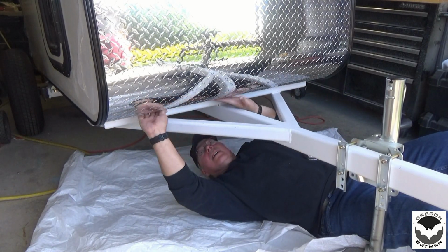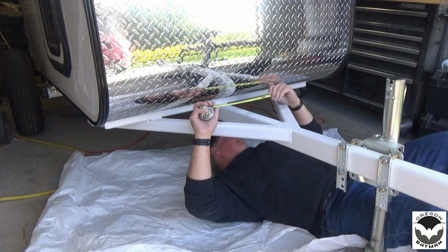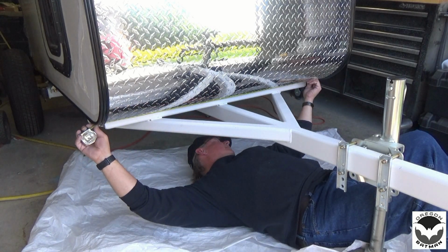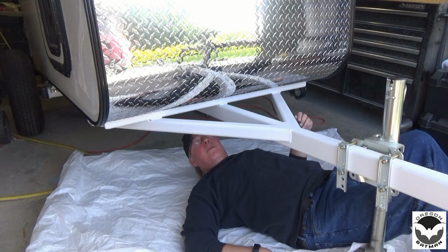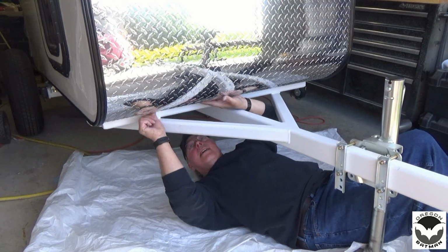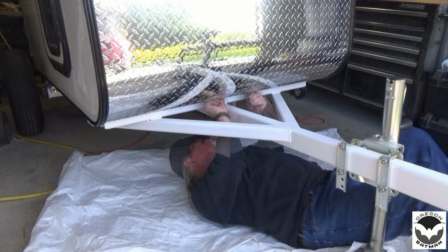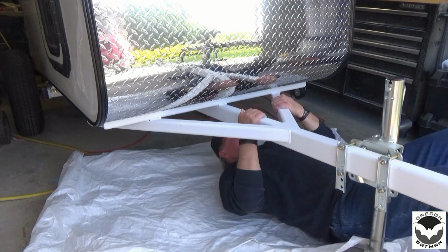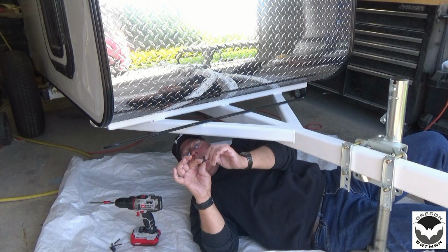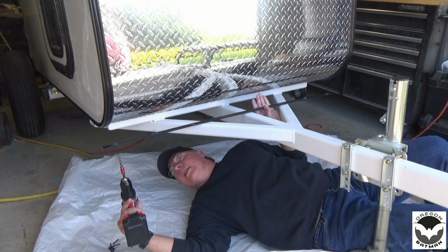Now it should be 46 inches, just like the front. Let's see. I'll need 2 pieces at 46 inches. And we can get that up there, screw fasten it in place, press my tape in there. Oh yeah, it's going to look good. Let's get it cut and stuck. Alright, we're ready to go. I'm using number 8 by 1.25 inch screws. We'll get that up in there.